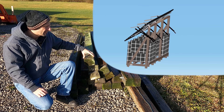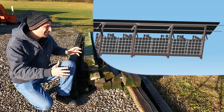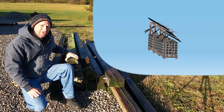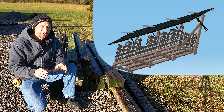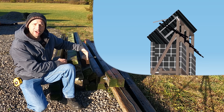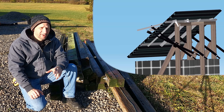What I have here is quite a few eight-footers and a couple of 16-footers. I made a CAD model to figure out how to make these all lay out the way I need them to. These beams are about four and a half inches tall and three and a half inches wide, making them a little bigger than a four by four. But even on edge, that doesn't make a really great load-bearing beam. I could stack two on top of each other and tie them together — that would make about a four by ten.